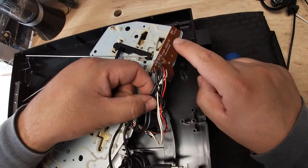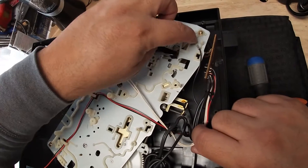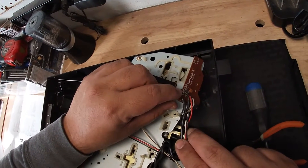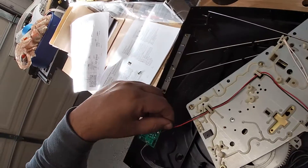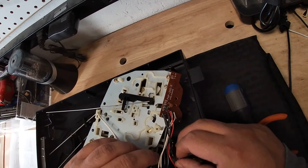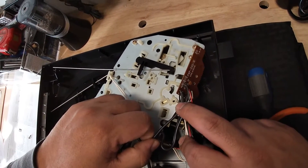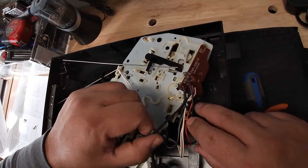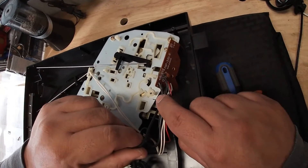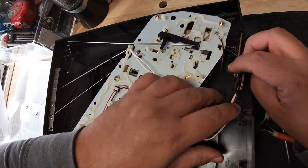Here's what I'm seeing from off the board: all the ground wiring is on this side of the board. I can see that this cable right here is clearly grounding the motor of the turntable connected right there. This ground here is presumably for the audio, and here's an extra ground. It appears that the power cable that powers this thing is already isolated, so there's no need to worry about any mixing of the grounds for the power and the cartridge.